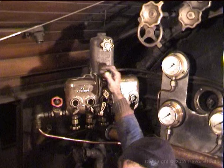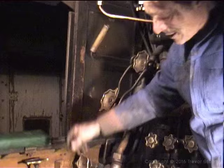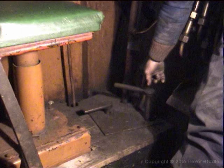I'm inside again. We've got the water valve. We've got the steam valve or cellar valve to operate the injectors. And this other lever down here is the cooler for the ash pan. You must see that it's coupled up when cleaning fire. That operates the ash pan coolers, which douse the ash inside the firebox.